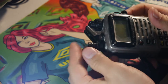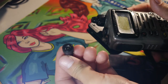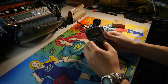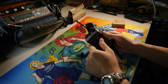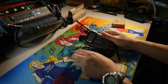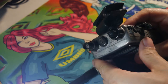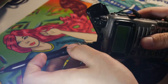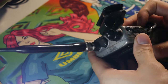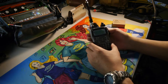This SMA to BNC adapter is about $6. You can get it at a local Hamfest or online, and it's supposed to work with most Yaesu radios. Most ham radios today are made with SMA connectors because they're cheaper to make, but they're not as rugged and long-lasting as BNC connectors — hence why I have a BNC converter on here. It's much easier to swap antennas in a quick pinch.